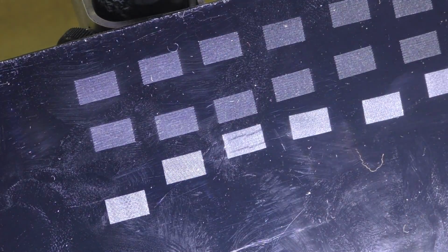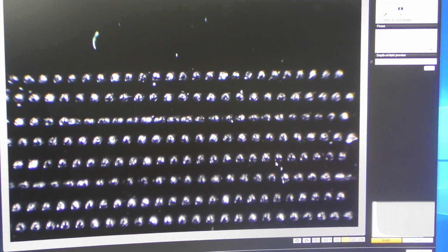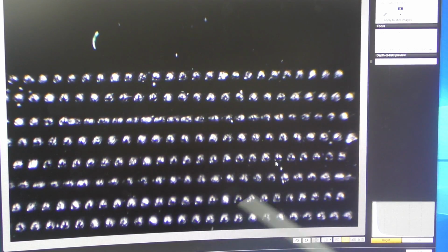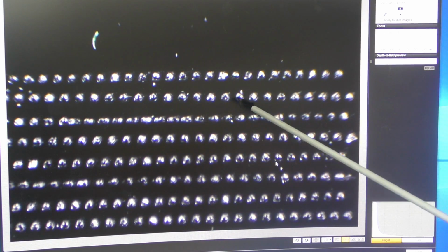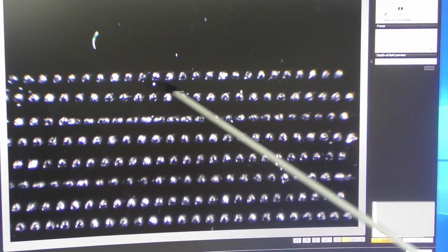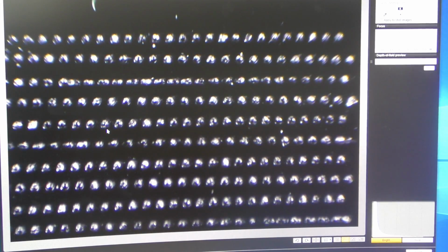Now, as you can see, I've done quite a few tests on there. You can see from a distance, look, there's an aliasing pattern on there, and there are patterns on this one as well. And I'll investigate and explain those when we put them under the microscope. Well, to cut a long story short, this is only part of that checker pattern. I found that when I was running backwards and forwards, I was getting really confusing images. So what I did was to change the line pitch from 0.1 to 0.3. As you can see, we've got lines that come from this direction and then that direction and then this direction. So I've still got my alternating lines, but they're spaced out. I'm missing two lines in between. This is at 10 kilohertz. Now, as I move around this pattern, you'll see something really strange.